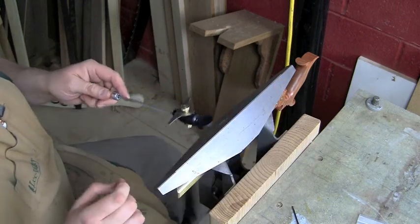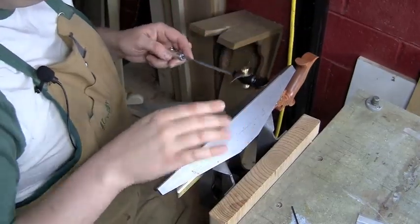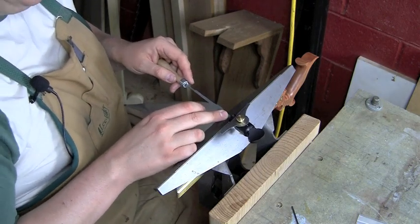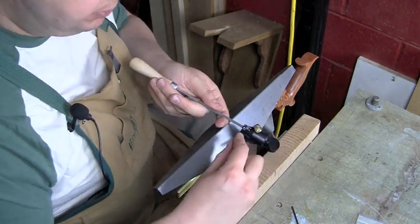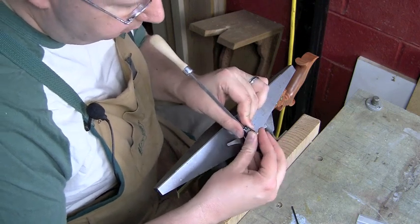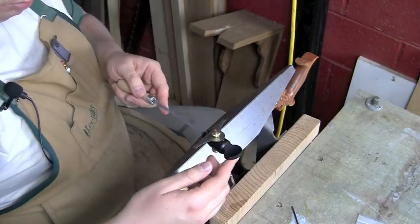So it's not going to want to tend to drift to the left or drift to the right because that burr is grabbing. So once it's turned around, the fleam angle of the fence matches, but the rake angle does not. So there is going to have to be some adjustment made. So I can flip this over and look down here and see that I'm at right about 5 degrees. So if I loosen it up and go to 5 degrees on the other side, now I'm angled properly